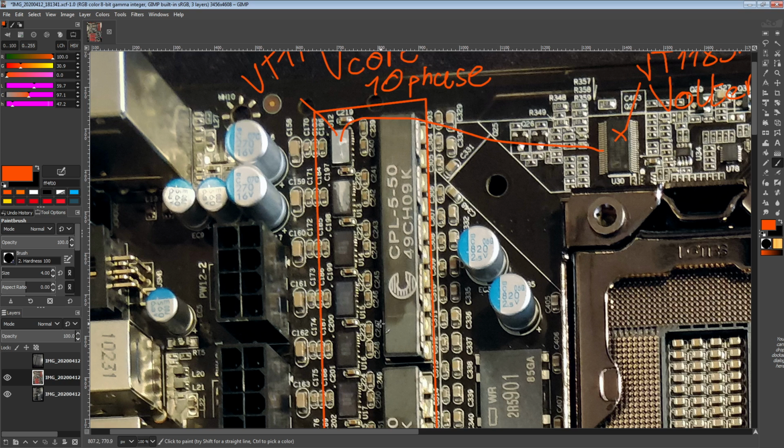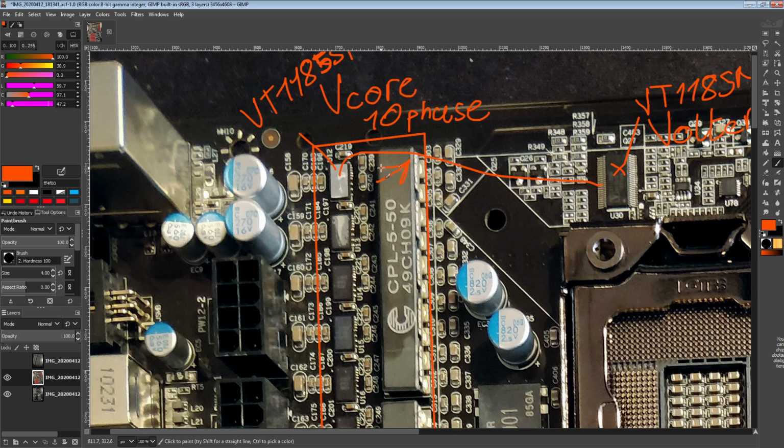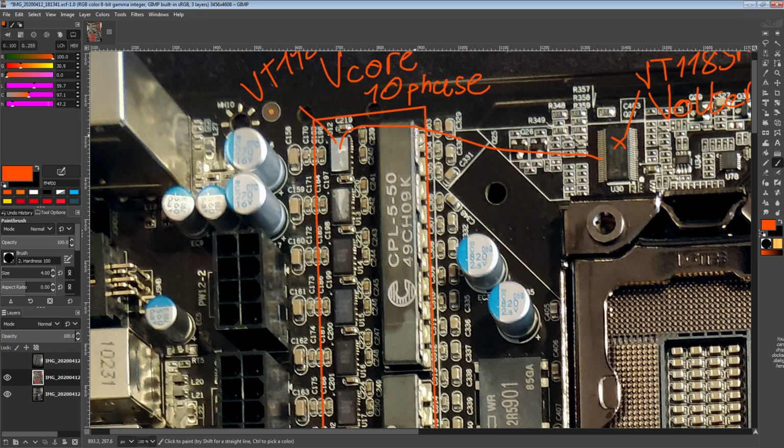Now, with the coupled inductor, if you turn on phase 1, the current through phase 1 starts to increase because you turned it on, like the high side is connected. But because the core of all of these inductors is one core with a bunch of inductors in it, the increasing current flow through phase 1 induces a magnetic field in the core, which is normal. That's what happens with normal inductors too. But because this core is also shared with all the other phases, that magnetic field now induces a current in all the other phases that are sharing that inductor.